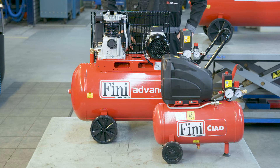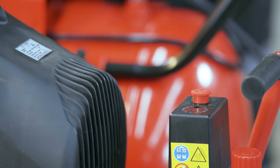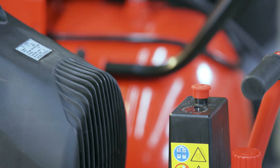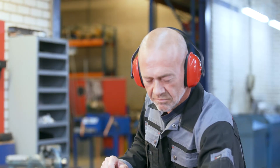The two main types of piston compressors I'd like to tell you about are the direct-driven and belt-driven compressors. A direct-driven air compressor has a crankshaft that's directly connected to the motor without any pulleys or belts in between. Because of this, this type does not run as smoothly as a belt-driven compressor. They're very affordable but also pretty noisy, so you'll need to wear hearing protection when the compressor is running.